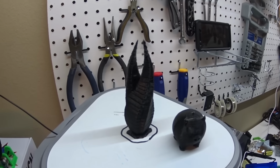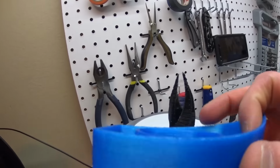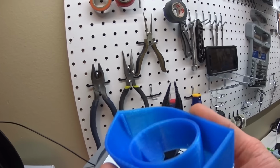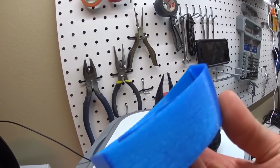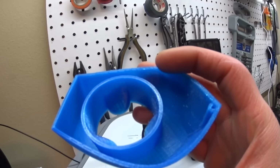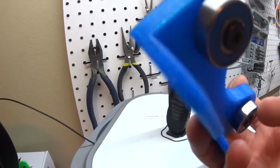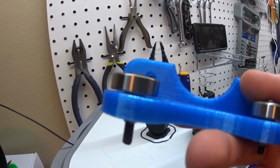So the gem filament, this was not printed on the Tiko, but the gem filament in my Ultibots K250, it prints just fine. So I thought the snapping issue was with the filament, but I think it's with the way that the Tiko homes and how long the bowden tube is, because that printer's a direct drive printer. And I printed a few things out of that filament with no issues, and the quality of the filament was actually really good, oddly enough.